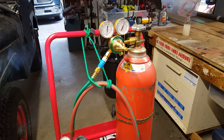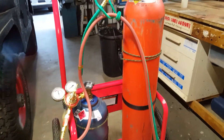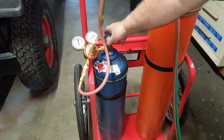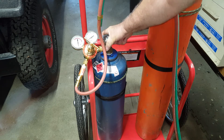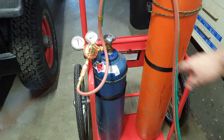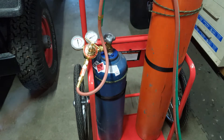The acetylene is a different story. With acetylene, you want to be able to shut off quickly - everybody will tell you this on all the oxyacetylene channels. Make sure there's no pressure on the diaphragm. Now open the tank just a quarter of a turn - and the pressure is already up almost the moment you open it. You never set these above 15 PSI. You can see it on the gauges - the gauge has the warning basically saying 'don't go above 15.'